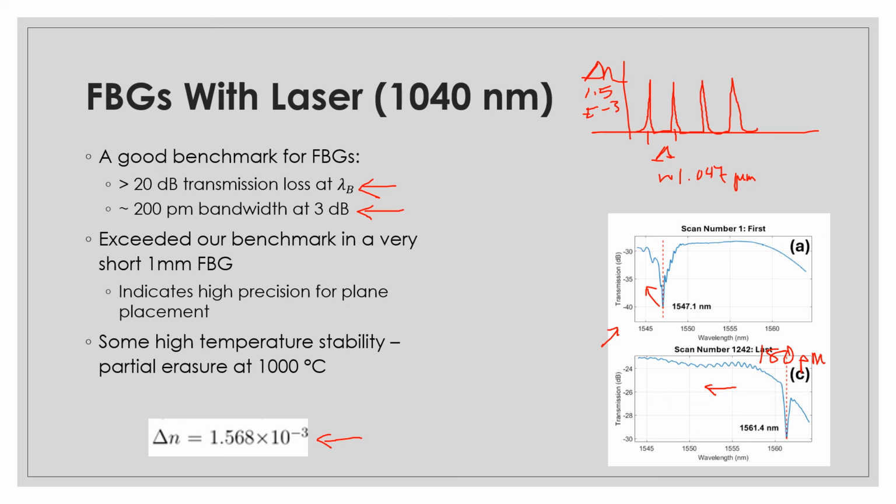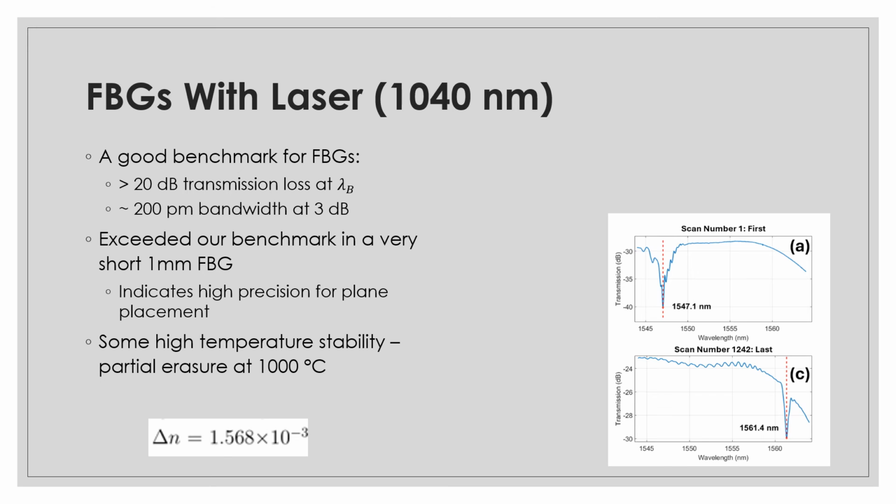And we took this grating and we annealed it at high temperature. Initially, we see that our grating has lots of noise in it, lots of little spikes and side lobes. As we continue heating this up to, I believe, about 1000 C here, actually it might be closer to 1100, a lot of those components have annealed out. Now we have a nice smooth grating.